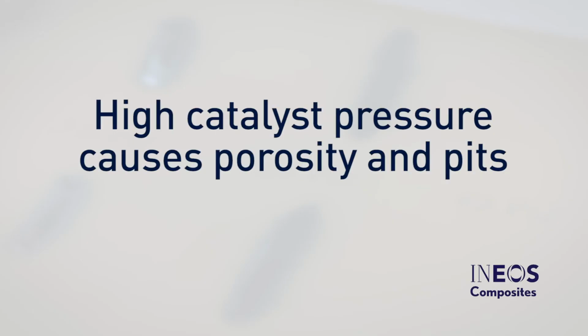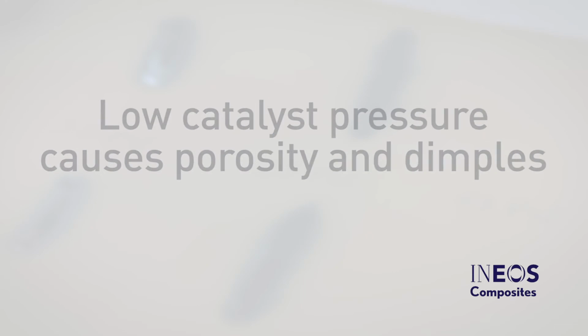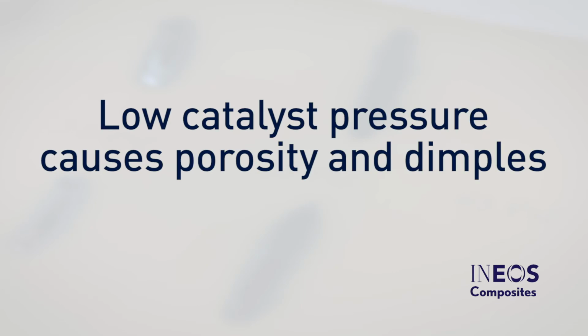If the catalyst pressure is too high, the raw catalyst can be blown through the spray pattern, which can cause porosity issues in large pits. If the catalyst pressure is too low, it will not allow the proper breakup of the catalyst and can lead to dimples and large porosity.